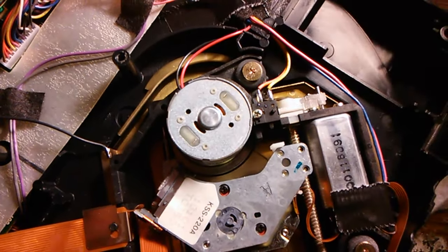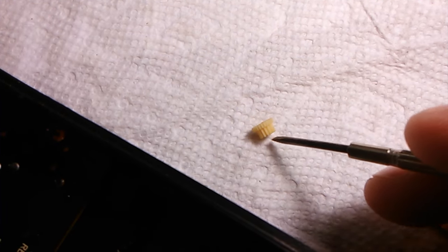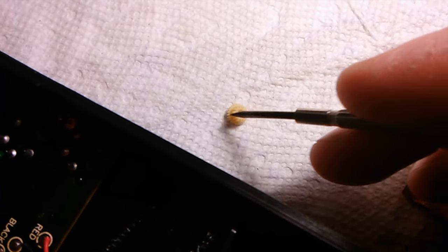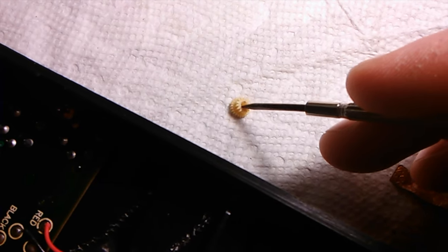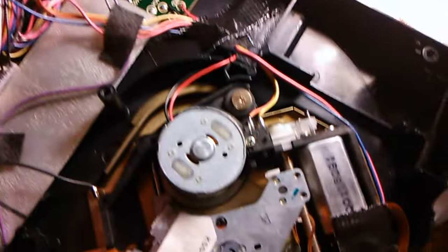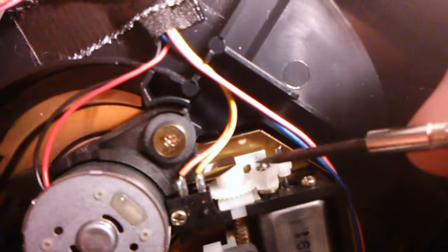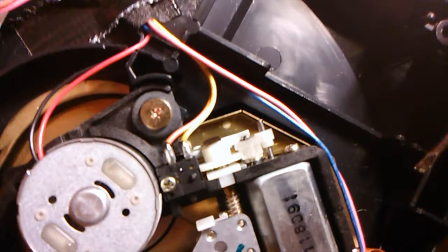The original, which I saved over here that I can show you. You can see it's super yellow. And this one actually isn't broken. Lots of times when these get older, they literally just fall apart, and I'll open up the CD drives and they'll just be in pieces. But even if they don't fall apart, they become useless, because the inner hole that I'm pointing at here swells and tightens. Then it doesn't spin freely anymore on this metal shaft through the center. So it just sticks and won't move.